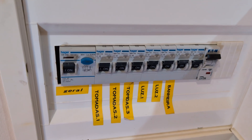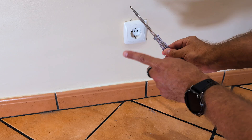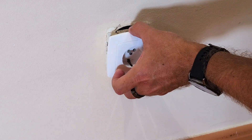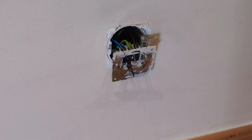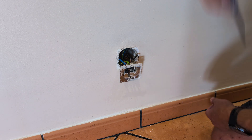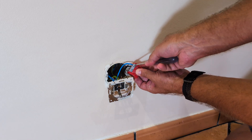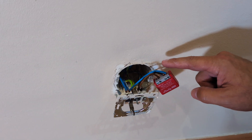After choosing which outlet I want to use, I just need to go to my circuit breaker and turn off the switch for that outlet before touching anything. I make sure the power is really off using my tool. Once I'm sure, I remove the outlet and find the live, neutral, and ground wires. The wiring is simple — connect the live wire to the input L on the Shelly, the neutral wire to the N input to power the Shelly, then a live wire from the output O to the outlet.